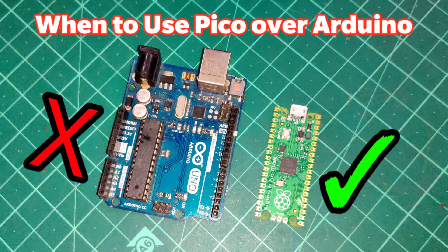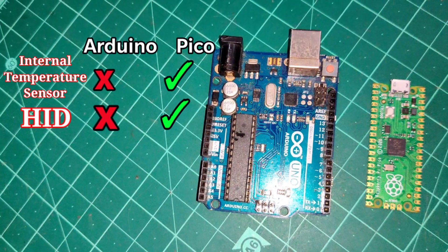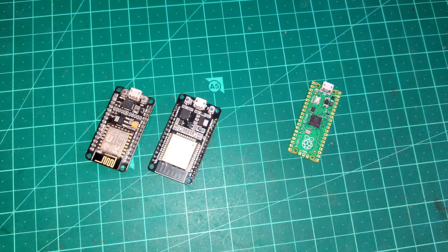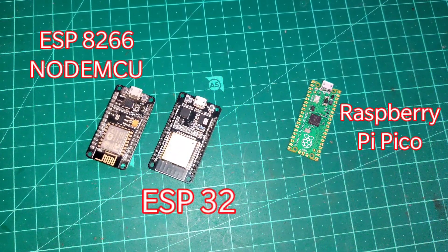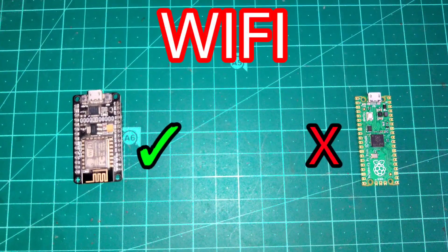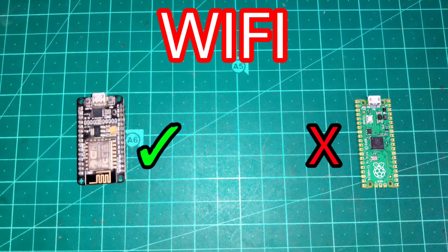There are scenarios where I would love to use Pico — when we need a better set of GPIOs, good onboard memory, a high clock processor, or an internal temperature sensor. And most Arduinos don't support HID by default except Micro and Leonardo, but Pico covers that. So I would love to make a keyboard or a game controller with Pico. Now the next big competitor is the ESP family. ESP8266 is a slower board with less RAM and more flash memory than Pico, but it has Wi-Fi and that changes a lot. So probably due to Wi-Fi many people will go with ESP8266 over Pico.